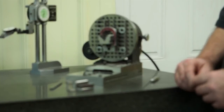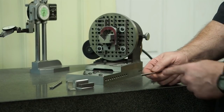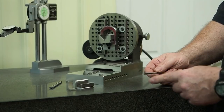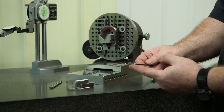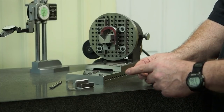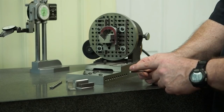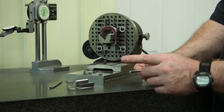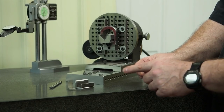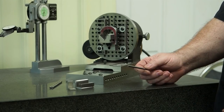When I used the Radiac wheel, the 100 grit, and I've done this same thing, I was able to grind down to the 150 without using any kind of stabilization on the end. And I was taking a thousandth at a pass, never even addressed the wheel before I started. Yeah, I had a special dressing process, which we'll demonstrate, and I was able to grind down to 150 thousandths without any taper, and it worked pretty good.